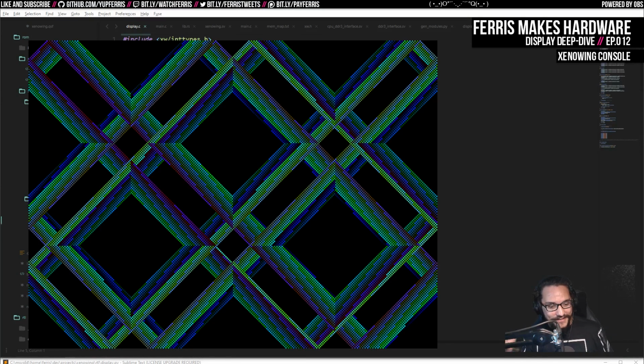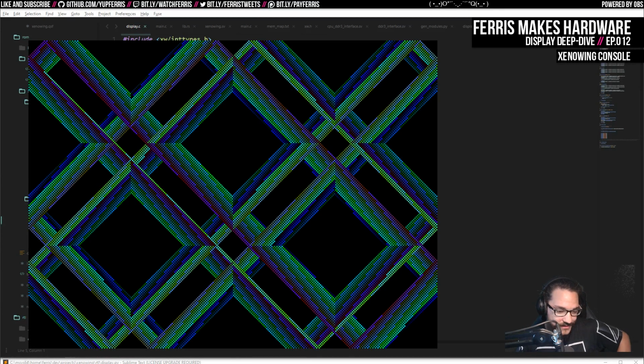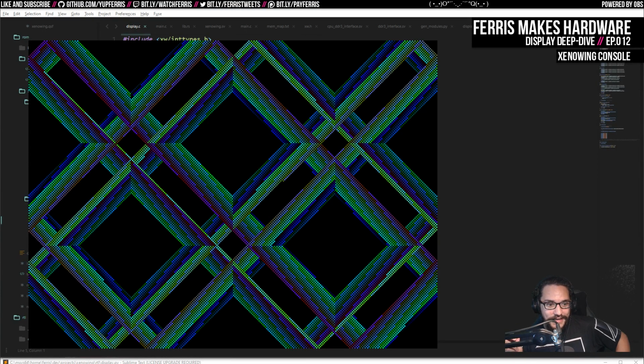So I Googled Metal Gear Solid resolution, and it actually runs 320 by 240 at 30 hertz. Now I still want to do 60 hertz, which is what I'm doing now. But then I just did the math for that. If we still do that double buffering scheme and we do all the burst reads, and even if they're 20 cycles per read,